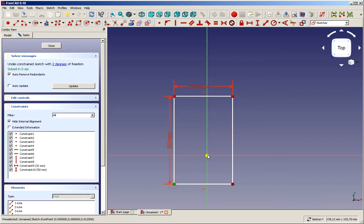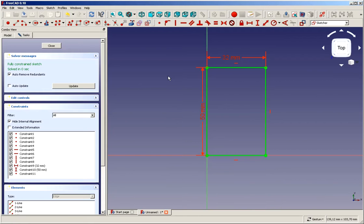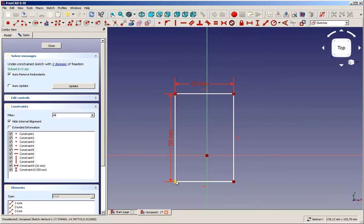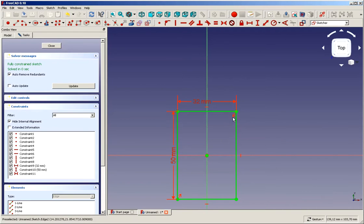Well, you could take the easiest way, and that would be you activate both points, one of the corner vertices and the origin point, and then you use the easiest coincident constraint, which is point on point. Well, that would be one possibility, but usually these drawings are centered to the center of gravity, and that is where lines between the vertices would meet. And we can do this by telling these 2 points and the last point, and select this one as the last point, not as the first or second point, always as the last point. These first 2 points are symmetric to the last point.